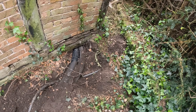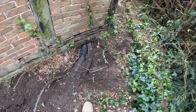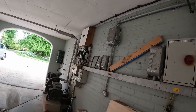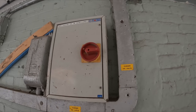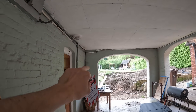I'm going to have to put a torpedo joint on one end and then somehow connect 35mm armoured temporarily — in a whisker box or something — so they still have power. We're down at the house now. You can see the armoured cable coming up along here. There are loads of different supplies here that are going to be changed over. I've isolated this by turning it off and I am going to lock it out and tag it out on the label to make sure I'm safe working all the way on the other side at that hut.